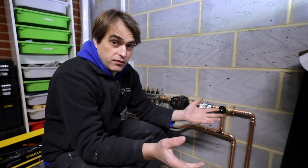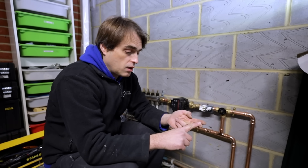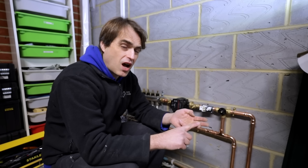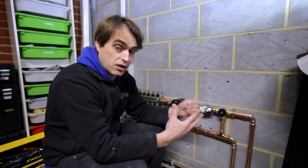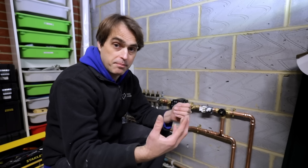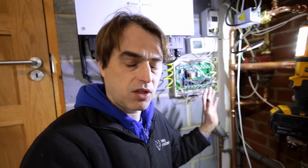It's a win-win-win situation. The only drawbacks of these setups are that they are more complex, more expensive to install, and not many people know how to install them. I hope my videos will change that, and more engineers will go out and install them, and more customers will demand these kinds of setups because they simply are better. That's your typical wiring center for underfloor heating — normally you've got actuators wired to it, one per loop.